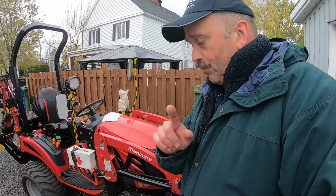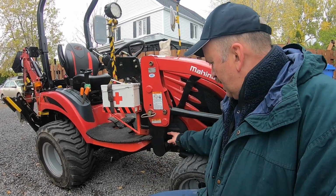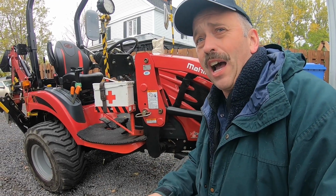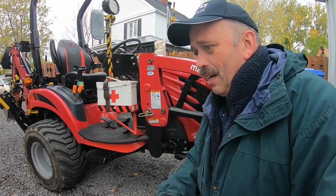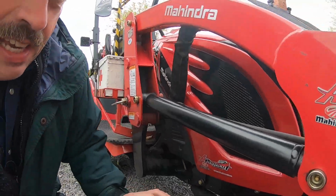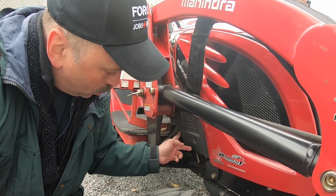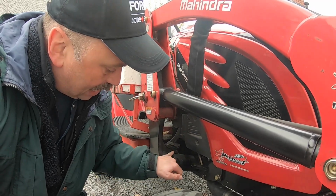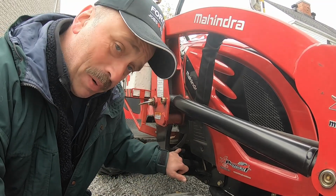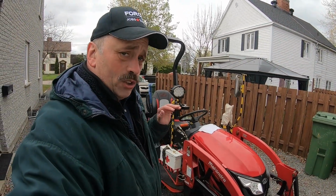The weakest point I have to say is how they pass the hydraulic lines. I'm gonna do a close-up. There's some chafing occurring, and I showed that in my video where I did a full strip-down. So just hold up. It's right here with my little finger. I put a scuff pad because the hydraulic hose going to the back was chafing against the reinforced gusset here. By putting a chafing pad there, it was really great, and I recommend that you all do that.